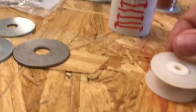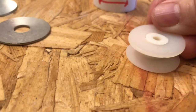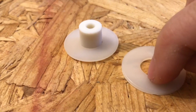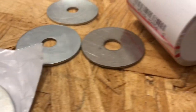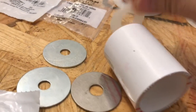So it's going to be a second coil. We're going to make two of these, not one — two little miniature pickup coils. You'll want to have a little slot right here to let the wire from the other end come out so you can get it through without damaging the wire. After this is built, we put one pickup coil on this end and another one on the other end over here.